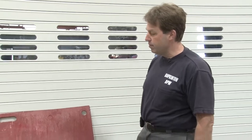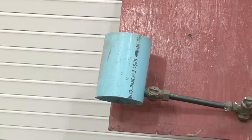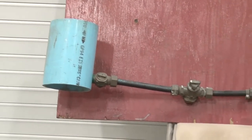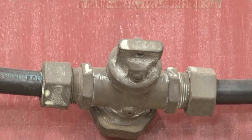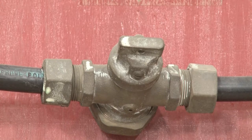The board we have here is just a demonstration of the water system and how the water gets into your home. From the water main, we have a line that comes into your property, and right at the property line we have a shut-off called the curb stop right here. That's something we're able to access in the event that your valve inside the home does not work, so we can shut that off in any emergency.